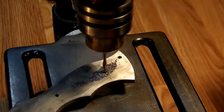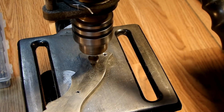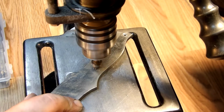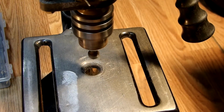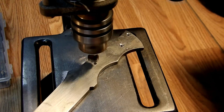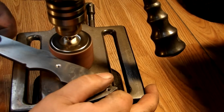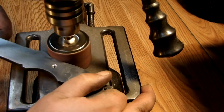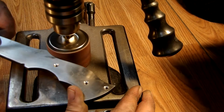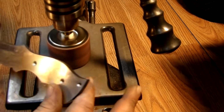And when you get done doing all those steps to the knife, that's when you see a lot of guys heat the knife back up, and then they dip it in oil or dip it in water, and that's called quenching. And what that does is, that takes your open hand, and then if you make a fist real quick, it brings all those fibers together, and makes it hard. And so you don't want it too hard, because if you drop it, it'll just shatter like glass. And so you want to stick it into an oven for about 2 hours at 350 to 375 degrees, and that kind of slowly opens those fibers up just a little bit, to where the knife won't be so brittle.